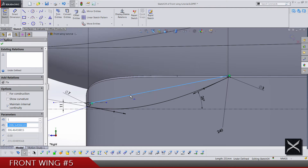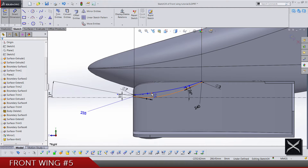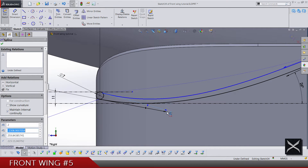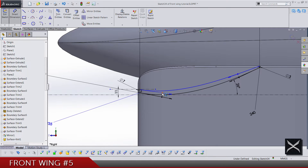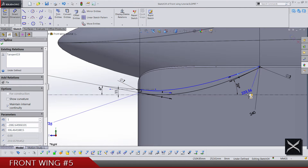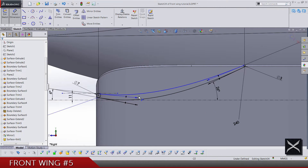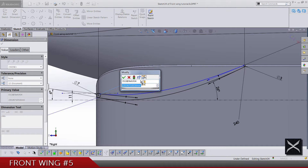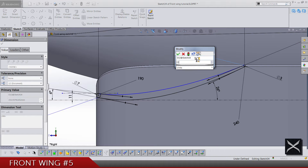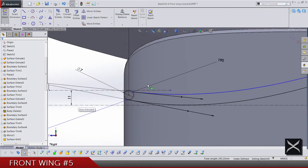Again two-point spline and we are done with the sketch — coincident here and same here. Again drag the handles. The angle for the left one: we actually have to put this handle in this direction to go down, just like this one, so then we can get the angle of 6 degrees. The right one is going to be 23 degrees. The distance for the left one is 190 and for the right one it's actually 330. Of course it has to be tangent here and tangent here.